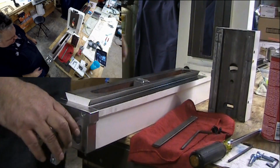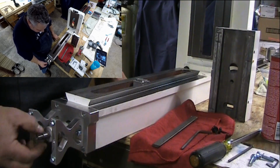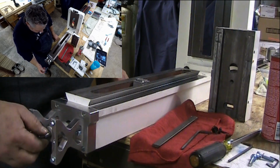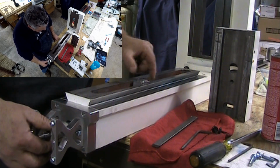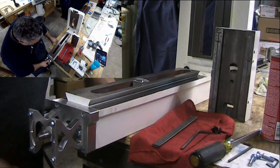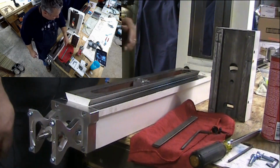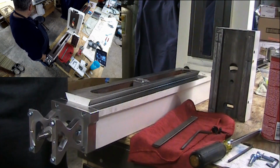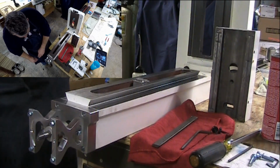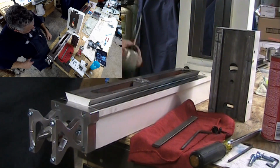Alright, I've got the mount put on, as well as the ball screw. I also machined a 1/2" to 3/8 adapter to put the cordless drill into to run the ball nut up and down. That seems to be running very nicely. So the next step is to put the slide on, and for that I am going to put some way oil on this.